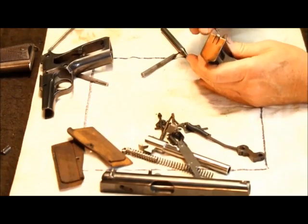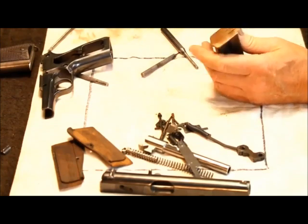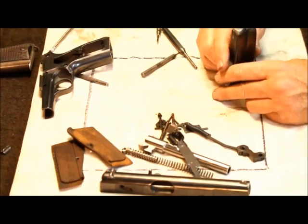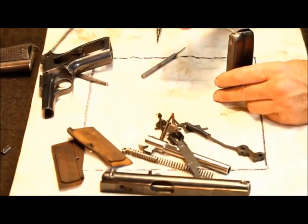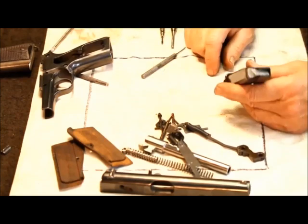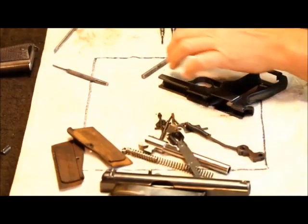We're going to just lift this clip up. I'm going to put it in a vise where I can kind of get a hold of it and get both hands on. Slide this plate off the end. Break down the clip and get it ready to blue. Now, we're not going to blue this follower here because I can see it is aluminum. Looks like somebody's already tried to blue it because it's kind of eaten a little bit. They probably threw it in the bluing tank a little bit, not knowing what they were doing, and it commenced to fizz and do funny things, and they probably stopped it, but it has eaten a little bit on the follower.